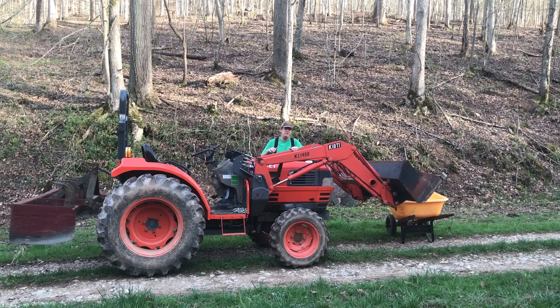That's where a four-wheel drive tractor and a front loader are a great marriage. If you've got a heavy load in the bucket and your rear tires are off the ground — and they're your only drive tires — you could be spinning and unable to move. With four-wheel drive, I've actually had the back tires completely off the ground, almost like a dog walking on its front paws, and been able to get from point A to point B. The front-wheel drive allows those front tires to have some pull power.